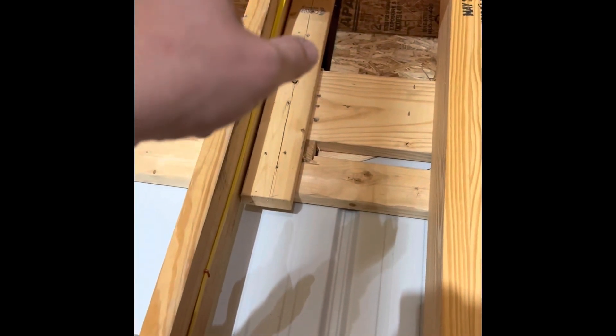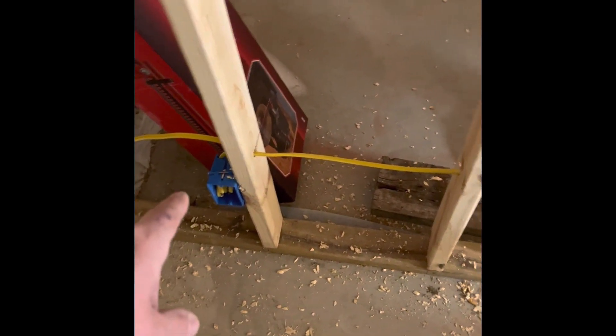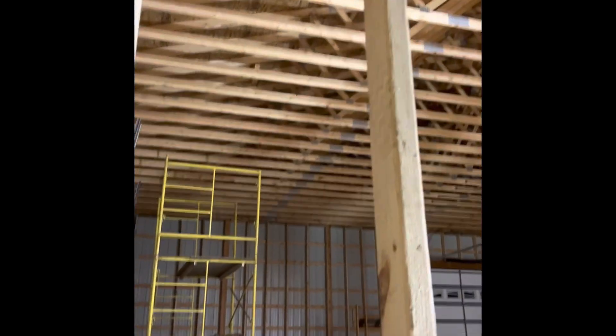From there it goes over here, up, because I can't drill through this to get into this wall. So I came back through my I-joist across, down that header to there, to that box, and junctioned off this one. I was going to go up and go across my I-joists, but my ductwork is going to be out in the garage and come down here, so I didn't want to have to worry about going around the wire.